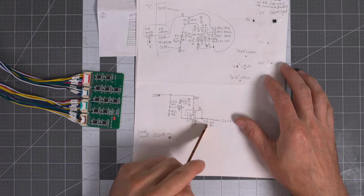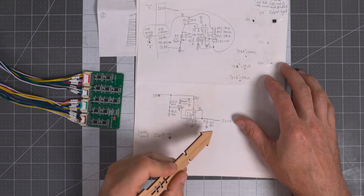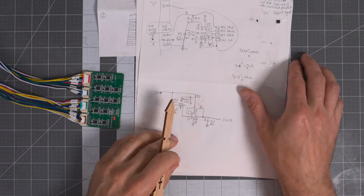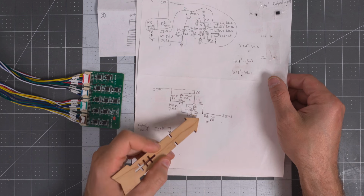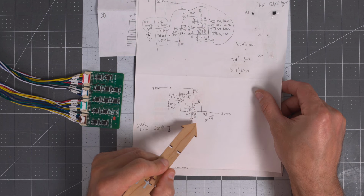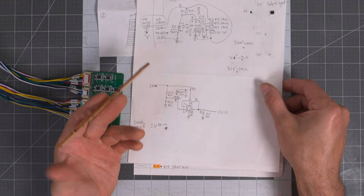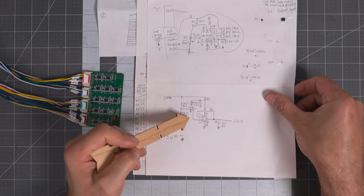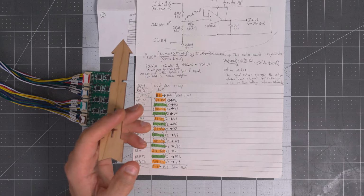We have this weird output load, this 2 nanofarads on this op amp. This pole is probably saved by the 1K resistor. It's probably browning out a little bit as the voltage changes, which hopefully it's not changing very quickly, right? Your battery voltage should change very slowly, but this is certainly a pole on your op amp, which could make it unstable. Now, of course, it's a voltage follower, so you don't really have any gain, so you're probably well within the gain bandwidth product. However, we don't have any filtering on the input, so these are just nitpicks, things that I would have done differently.